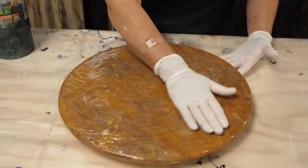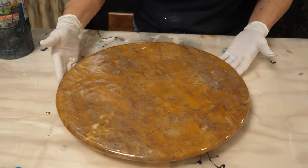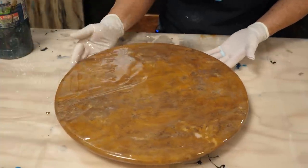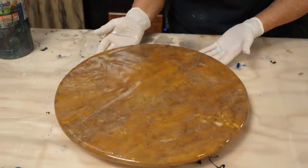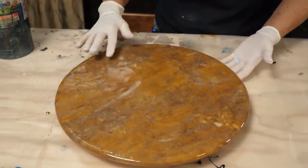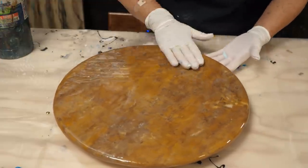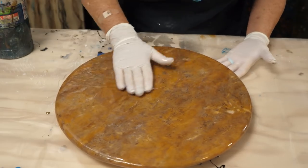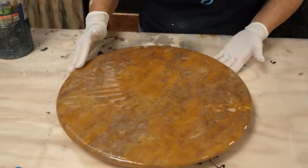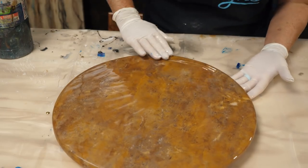Yes, so like Leslie says, the reason I'm wanting to use my fingers to roll over the edge is because I'm helping that epoxy to roll all the way under, and epoxy's gonna roll and go much easier if there's already epoxy there on the surface. So, pro tip on your edges, make sure that you rub those edges and it'll help the rest of that epoxy roll over.